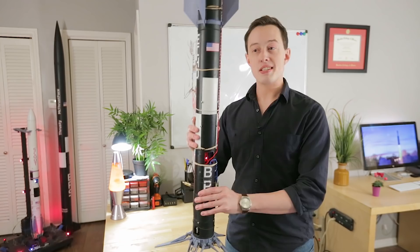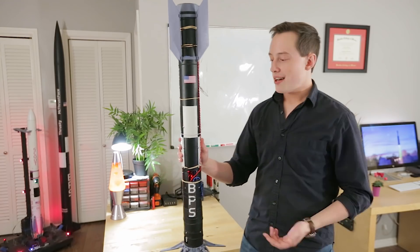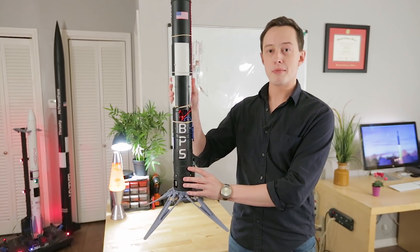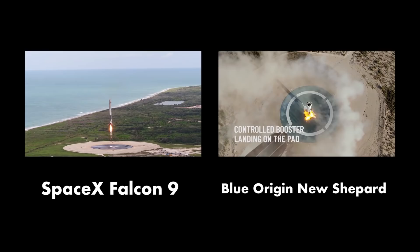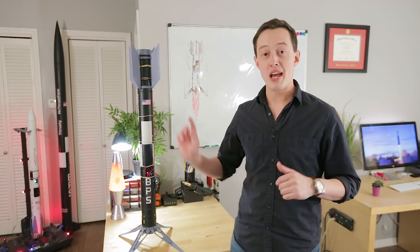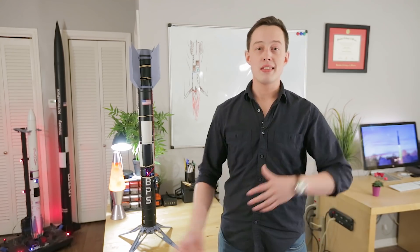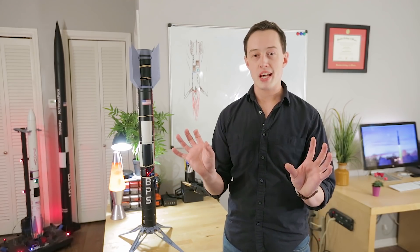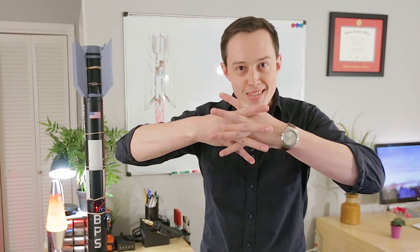This is the Echo Rocket. It is a purpose-built vehicle to be dropped from a UAV and attempt to land propulsively. It's about a kilogram in mass, about a meter tall, and it's got a little flight computer, a thrust vector control mount in the bottom, and some passive fins up top. The eventual goal is to launch and land in the same flight, just like a SpaceX Falcon 9 or Blue Origin New Shepard. We have the Scout vehicle to dial in the launching stuff, and the Echo vehicle to dial in the landing stuff — the idea being you can simplify a lot of these problems by having two separate test programs, and eventually put them together.